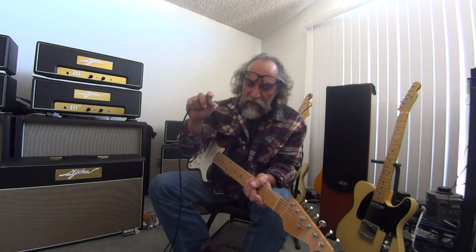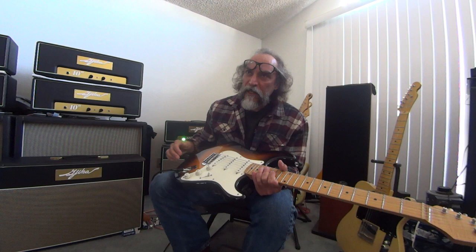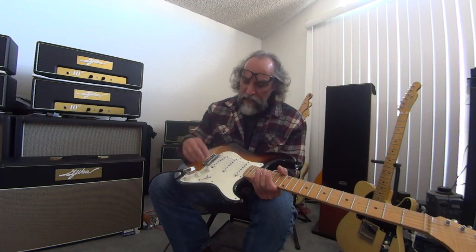I have people bring me pedal boards all the time and say, my board doesn't sound good, and I'll twist their cords and say, try it now. And they go, you know? Because you can't leave that thing just plugged in. Oxidization and crap builds up in that little tiny surface contact. And another thing I've thought... It's your guitar cord then, huh? Yeah, you plug it in every time. And the one into the amp. Yeah, right. So in and out.